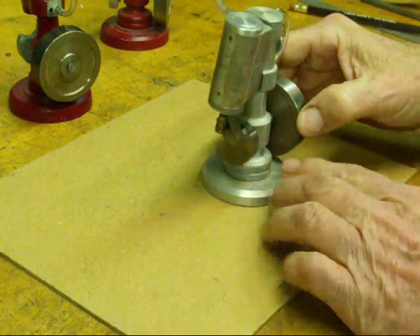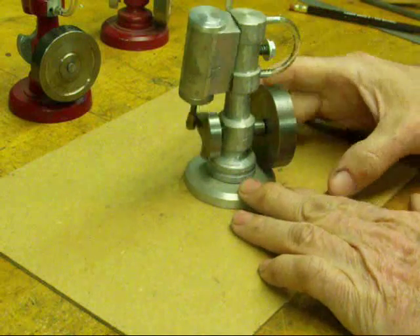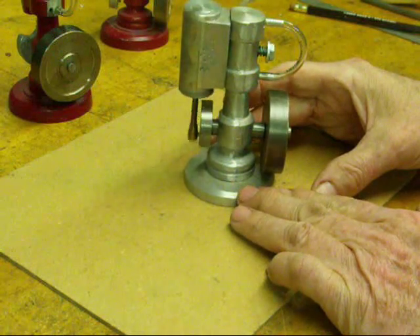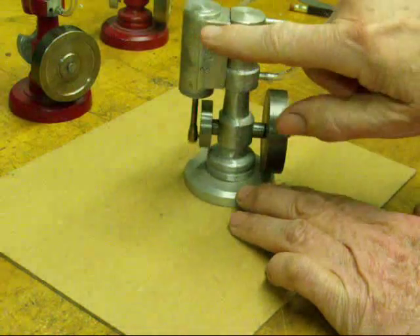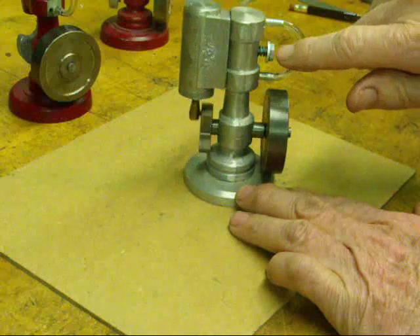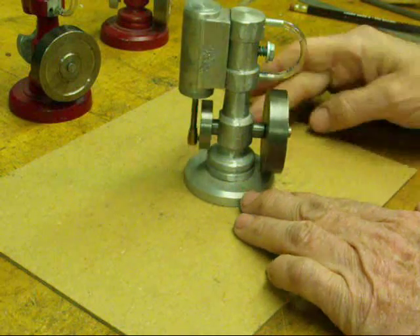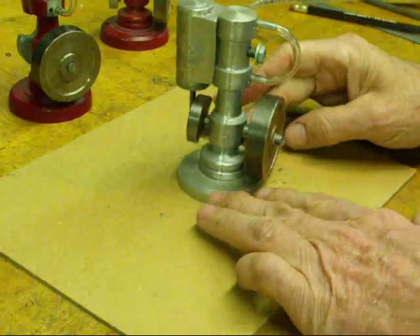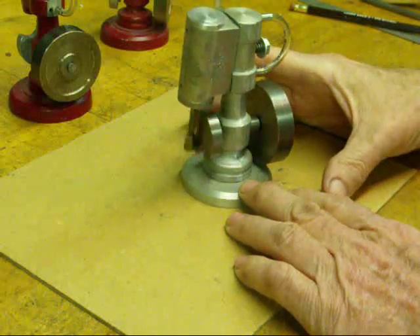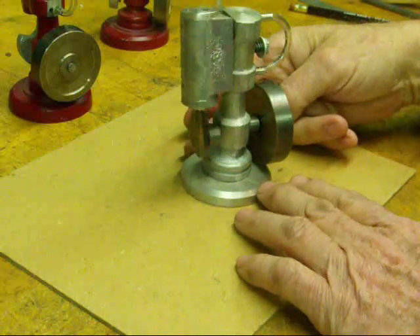This is one of the earlier ones that I made, and this piece down here is steel — it's not a casting. There's a little steel bearing down there rather than brass, and you can see the base is a little bit different too. If you make a series of any engines, you make improvements as you go along. There's a little shaft holding the cylinder onto the pedestal, and then there's a spring and a nut and a washer there that allows it to wobble freely. You do need good alignment and careful machining when you do this. All of the practices of a good machinist will show up as you complete your engine. There should be no binding or tight spots — it should be free in all positions as you turn it around. If you've got binding, there's something you did wrong or inaccurate.